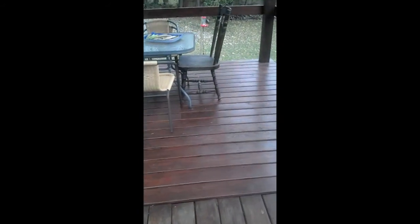Basically it. Then of course I painted it, you know, I put some weatherproofing on it. It's, I forget what it's called, Australian timber oil, I believe. It's about 3 coats on it. I mean, the water beads up on this stuff too. It's very nice. It's called Australian timber oil. It costs you a little more, but it's worth it.